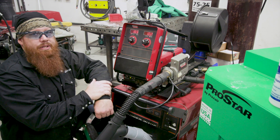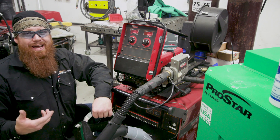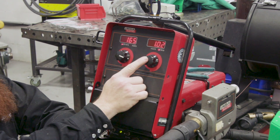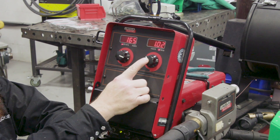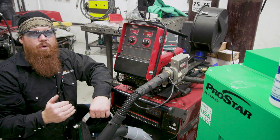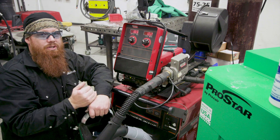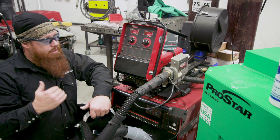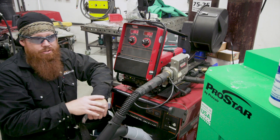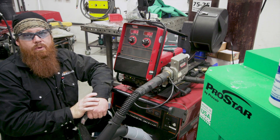Let's cover some settings and pertinent details. We're running 0.045 diameter 70S6 wire. We have a 90/10 gas mix — remember, you've got to have 82% or higher to achieve a true spray transfer. We're going to be running 165 inches a minute, and after a couple of practice pieces, we're going to hit 1.02 on the trim. Always, always mock up a piece on the same material and same joint configuration to dial your settings in, especially if you're not working off a WPS. It's going to make your life a lot easier — a lot less grinding.